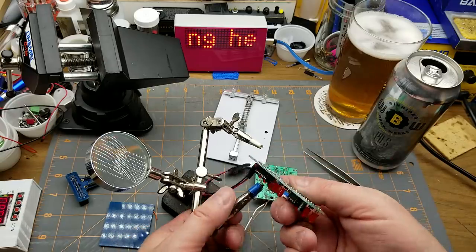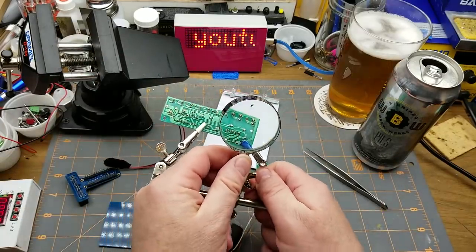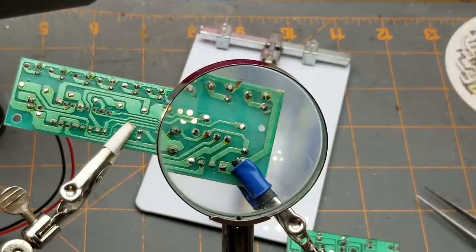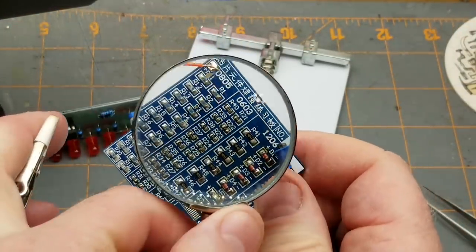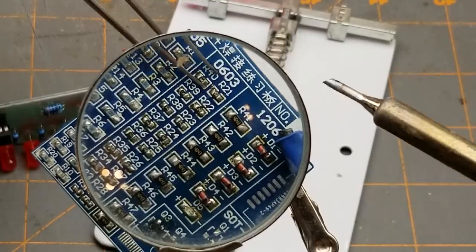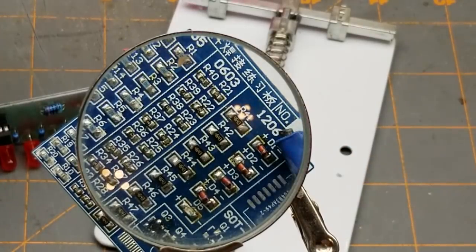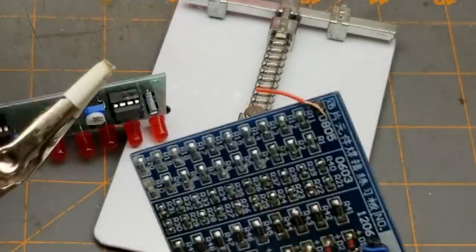You can grab a board by a couple of spots and get a good solid grip, and use the magnifying glass to get in closer if your eyes are getting old like mine, just to see what's going on. That magnifying glass works surprisingly well in surface-mount world too. Looking at those little 0603 components — there's no way somebody as ancient as me could do those without some optical assistance. It's definitely a contender, although the joints get weak and floppy over time.